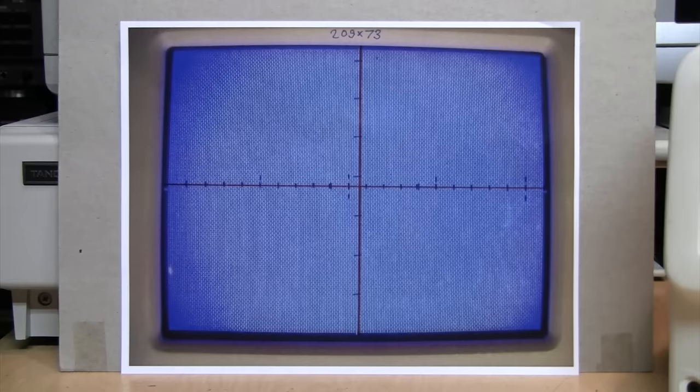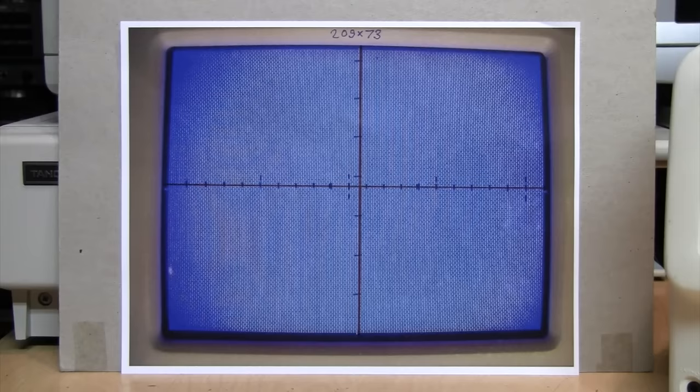However, it is true that the electron gun can illuminate only part of a pixel as it scans across the screen. So CRTs have an inherent form of sub-pixel rendering. So that is not necessarily a hard limit to the viewable resolution. And when I'm zoomed in on it, you may notice that the phosphor dots are actually staggered by half a pixel. So you could say that that provides the equivalent of doubling the vertical resolution just on every other column.